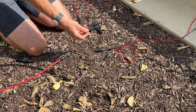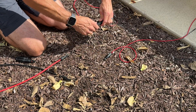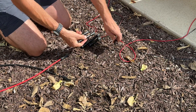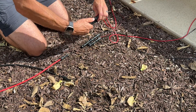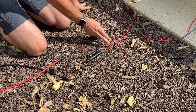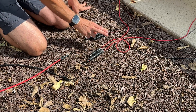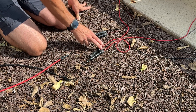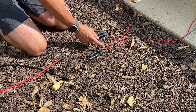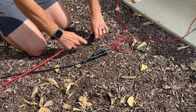You can get Y-splitters that give you a little more of a pigtail, or these rigid ones that are a little more compact. For this setup we can just use the rigid ones. We're going to bring both panels together in parallel, which will maintain our voltage and add up our currents. Just know that if you're doing a permanent setup, you would also want inline fuses matched to the maximum current capability of the panels — in this case I would put 10 amp inline fuses on each branch to protect the circuit. But for this temporary setup I'm going to go ahead without those.